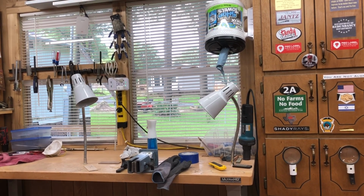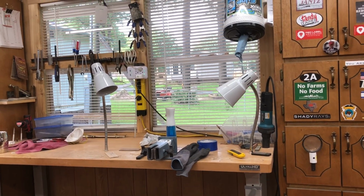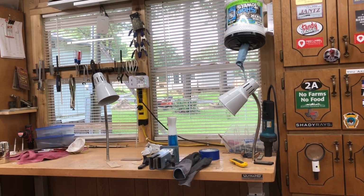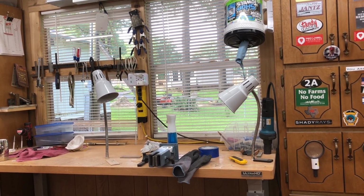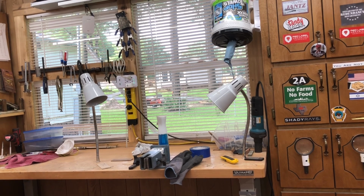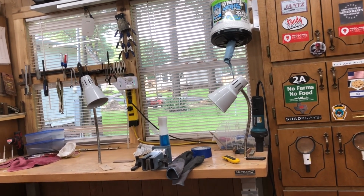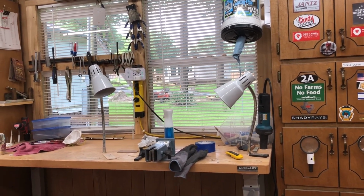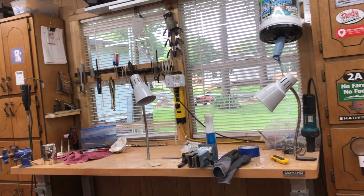And the high-end Jet was $1,000, and I read a lot of reviews, and the runout was in thousandths, and at the drill, above the flutes, it might have been 3 to 5 thousandths, which is well within acceptable parameters for drilling holes. So I almost pulled the trigger on the Jet, and I thought to myself, I can get better tolerances with the mill drill that I was looking at at Harbor Freight. So I did not want to buy the Harbor Freight one, plus they don't have one. So I looked at Grizzly, and nearly identical machine, same horsepower. It actually looks identical. Was right at $1,000 delivered.